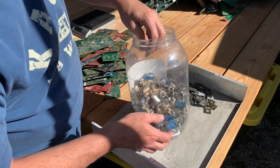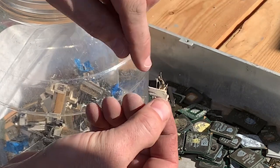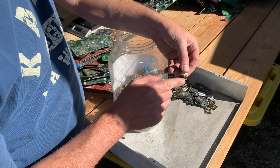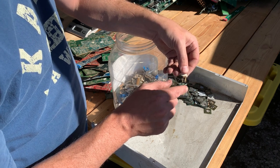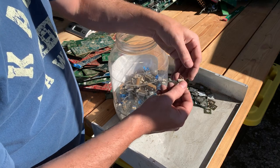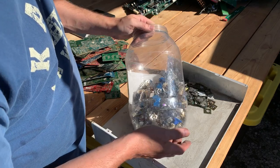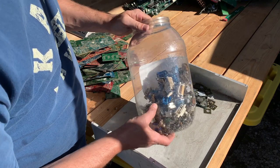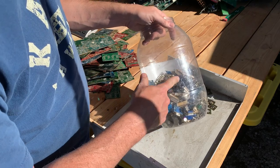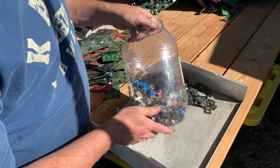All of these video adapters have pins of some sort. This DVI connector has gold-plated pins all the way down to their solder points — though not all will be so thoroughly gold-plated, and they'll have different thicknesses and purity. It's probably 8 karat or less, plated so thinly that you'll need a ton of them to make much. There are also MLCCs and SMD resistors that have silver and other precious metals. I don't have a good estimate of how valuable this bucket is right now, but there are a lot of pins on all those connectors plus all of the debris.